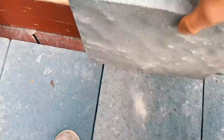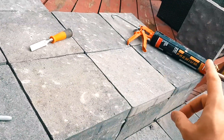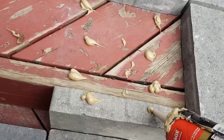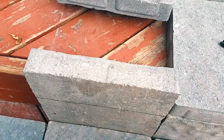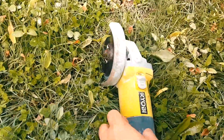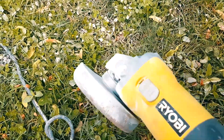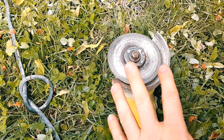Flip this around so you can have it on both sides. Then use the PL glue to apply it on top here on the deck, and as long as there's enough of a blob it's all gonna fit like this. This dried overnight. We're using a basic 4-inch Ryobi with a diamond blade — whatever you buy for 40 bucks can do just fine. This has lasted me for the last four years; I've been cutting pretty much every single project with this, so it's good.